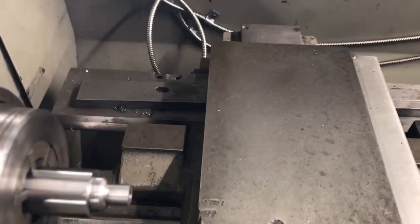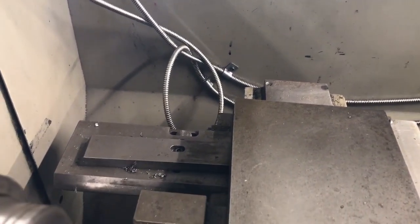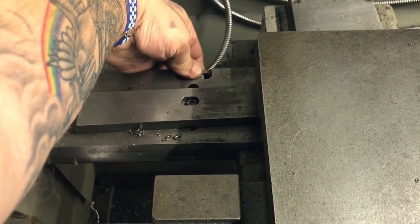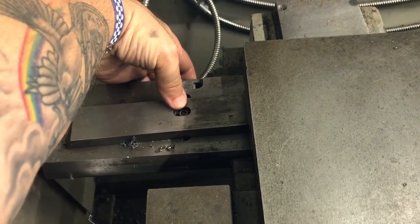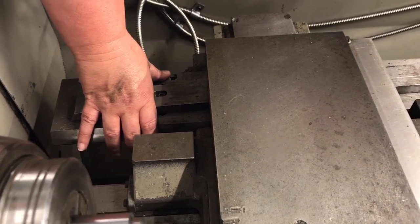So I need to come back over here, loosen the screws back up and redo the adjustment to make it slightly less steep. What I usually recommend is because I'm going in the opposite direction, if you don't know which way goes which, it's easiest to move the adjustment the other way before you loosen this so you don't get backlash in it — makes it more predictable. Just make a very slight adjustment — we're talking two and a half thousandths over an inch — and then tie it back down.